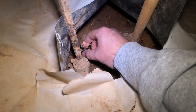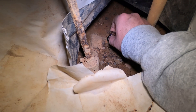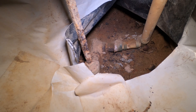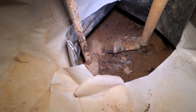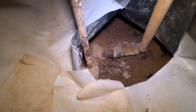Feeling resistance. Test there — it's sticking. Once more, underneath the dirt — still sticking. So I'm fairly certain that this is a galvanized pipe and not lead or copper, which means I should be in the clear and not need to have the line from the city to my house replaced. Hopefully this helps you.